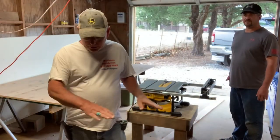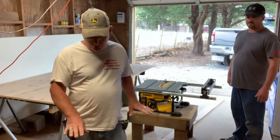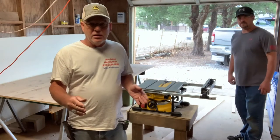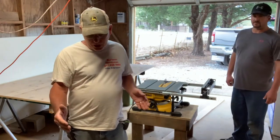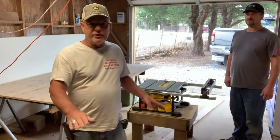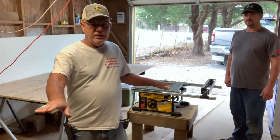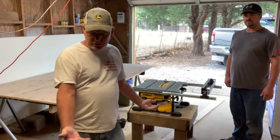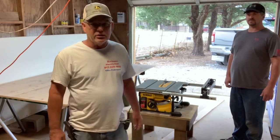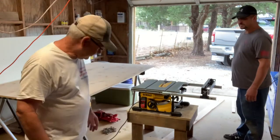I've got my measurements all laid out on the floor. I've transferred them from measuring over at the house to the floor. We added a little bit of space for the scratch coat and an inch and a half for the rock. Once I got those measurements on the floor, I could add the top of my mantle and figure out where my return comes back so it doesn't bump into the concrete board that's already installed. So we're fixing to rip this piece of plywood and go from there.